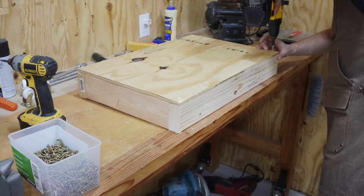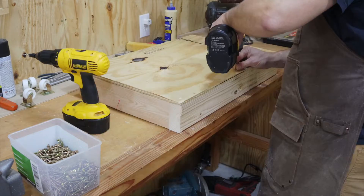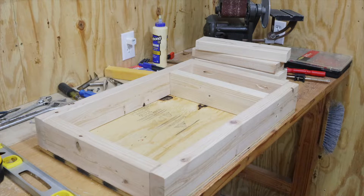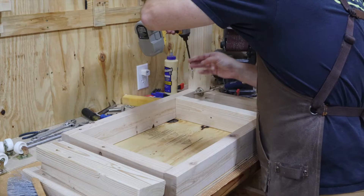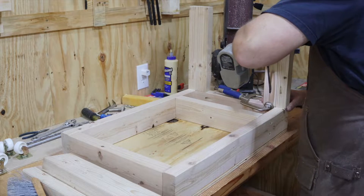Pre-drilling and counter-sinking where the screws are going to hold the plywood on, just to keep everything nice and trim. I added a board on the bottom tier to keep the shop vac from rolling around — plus it gives a little compartment for accessories. The vertical boards will also be held in place by pocket screws, and I use my face clamps to hold these in place and keep them square to the bottom boards.